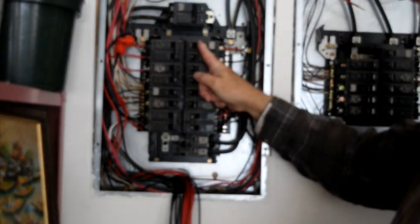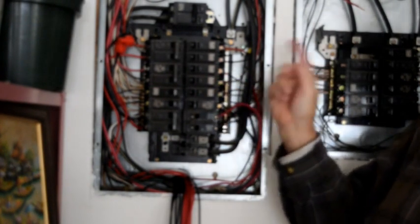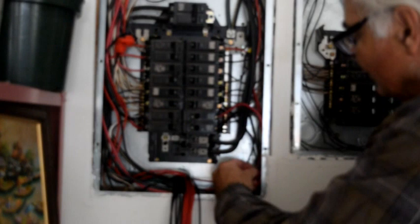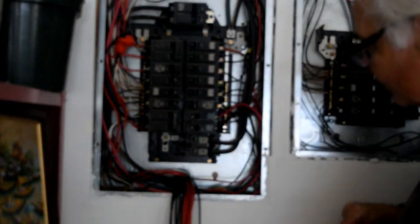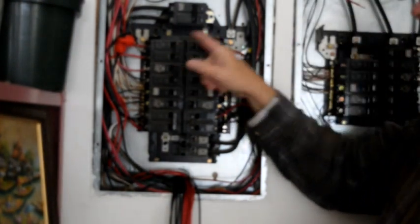I'm going to go into the other room now and turn the well and the furnace to line on the transfer switch so they will work again. The furnace was on circuit F and the well is on A and B. I've got ten circuits total wired up to the transfer switch, so everything we need is hooked up. All I have to do is supply power to the transfer switch and we'll have backup power.